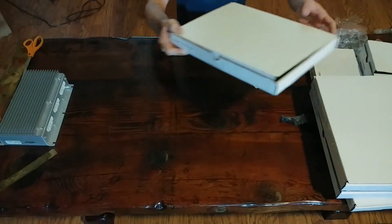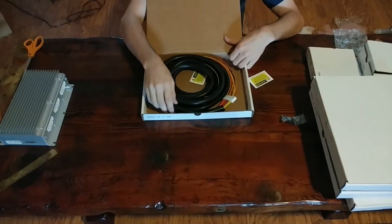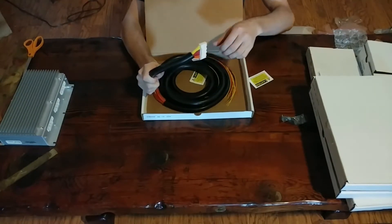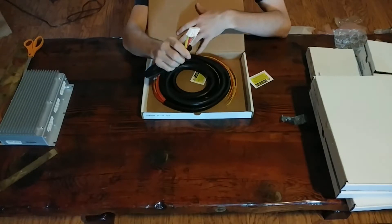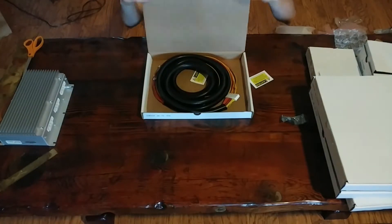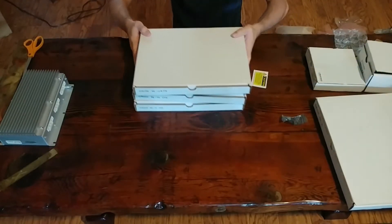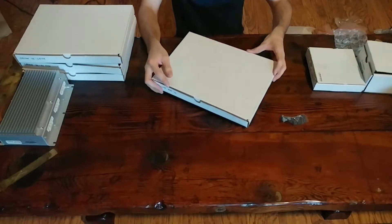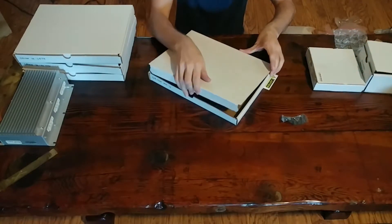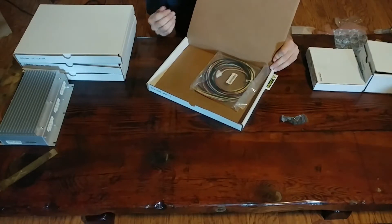I also have wiring harnesses here. There are three 36-cell wiring harnesses where each one connects to a group of cells — I've got three boxes of those. I've also got the wiring harness where CAN bus and 12-volt power and things like that come into the BMS.